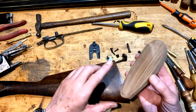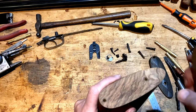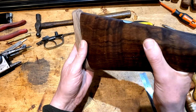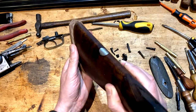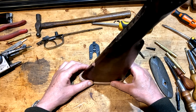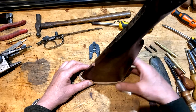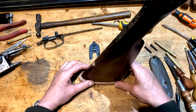Okay, so with that linished and roughed out, and that is flat too, we have to ignore these drill holes, unfortunately. And what I need to do is plant that on with some glue. The glue is there just to hold it in place. And then I have to decide whether I'm going to plant that on and just leave it with the glue or put some screws in it. I need to go into my vintage box to get some nice screws if we're going to go for the screw route. And then the checkering would ensue after that.